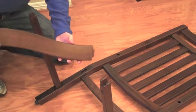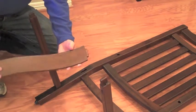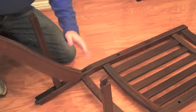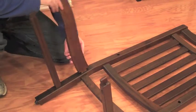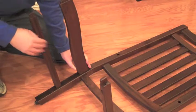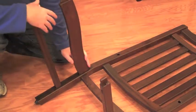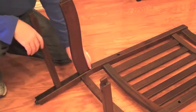Next, we're going to install the shaped side rails. There's also a small and large tenon on these pieces. The lower dip in the shaped side rail goes toward the back of the seat. Slip them into the joint and align them with the straight side rails — they'll angle out a bit. If installed wrong, they'll angle in or won't line up with the side rails, so watch for those details.